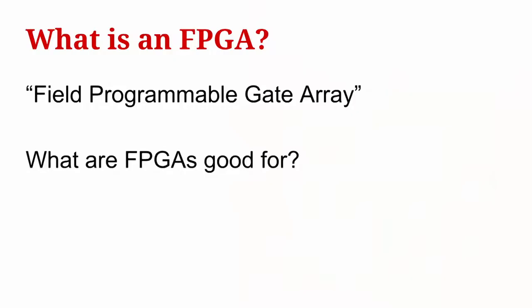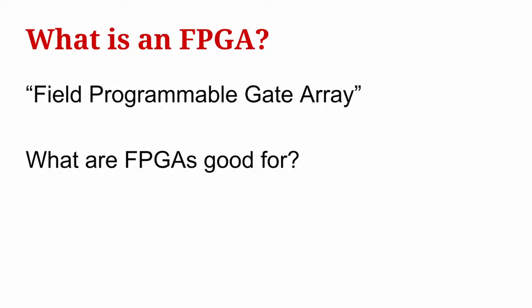So, what is an FPGA? The acronym stands for Field Programmable Gate Array — an array of transistor gates that you can reprogram after manufacturing to take any arrangement you like. It's a programmable circuit, an interesting combination of both software and hardware, which you can use to implement any algorithm you can imagine and solve any computable problem. They're often faster at solving specific problems, especially those that can be computed in a highly parallel way or in a more gate-efficient manner with a dedicated processor.